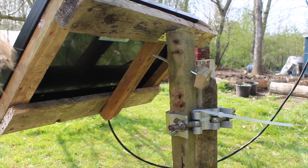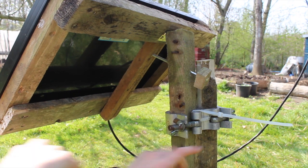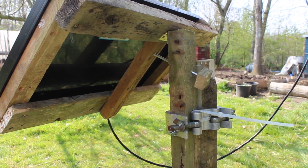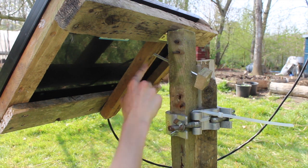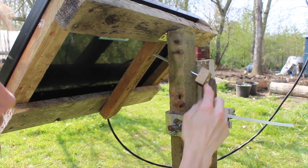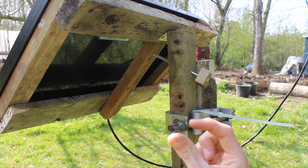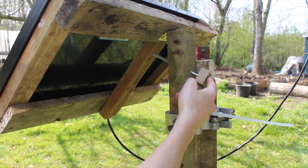Then you've got your main post in the ground as you can see there, and then there's the scaffolding joint which does rotate — that's why there's this cable tie, because it holds it up and stops it rotating freely. And to make it tilt, it's a coach bolt — it's got a hex shape underneath the rounded bit.